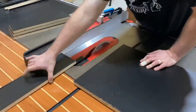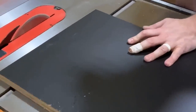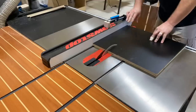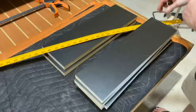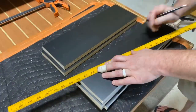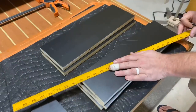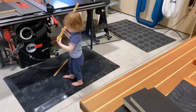Cutting some of this black laminate down to be the drawer faces — and yeah, I cut my finger pretty good on this stuff, so be careful; the edges can be quite sharp. With the drawer faces cut, I need to find the dead center of them. I'm going to draw a line from corner to corner making a little X — this helps me find the center because I'm going to use a single drawer pull.